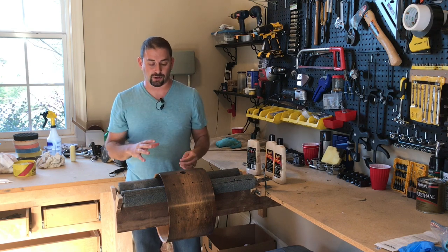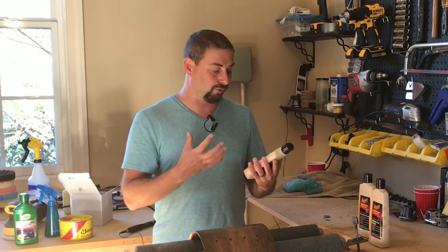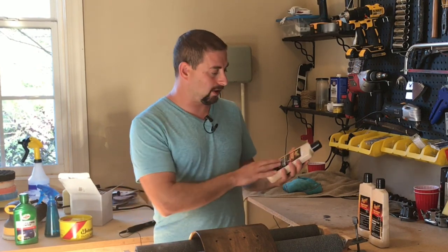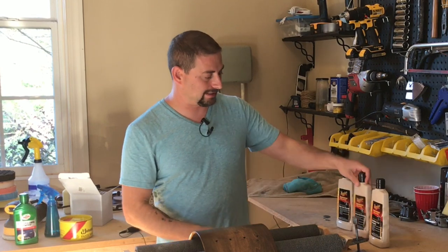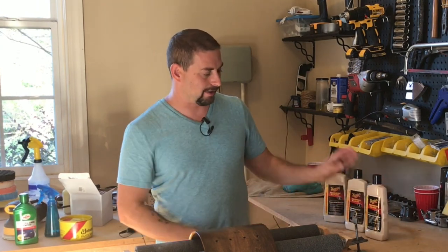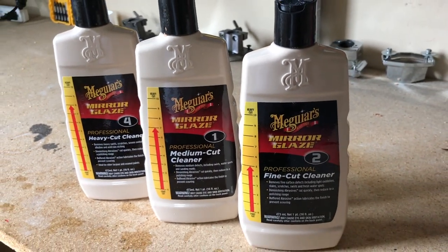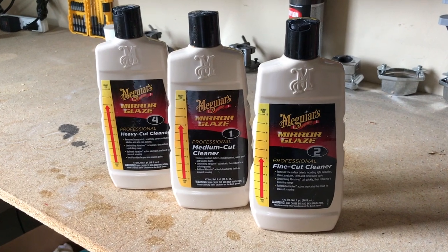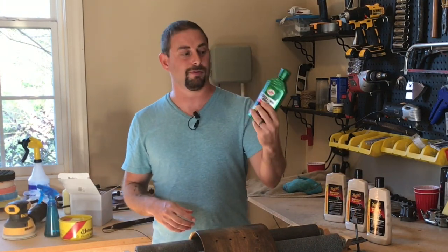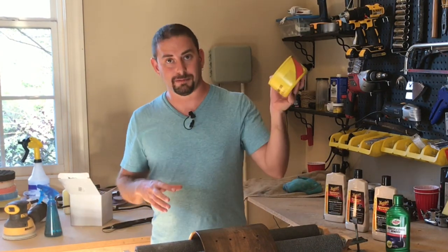Looking online at the best way of rubbing out and finishing these drums, I found these abrasive compounds. Basically this is a liquid that has grades of sand in it. The liquid is spread across the surface and cuts down the finish based on how much abrasive is inside the compound. What I have here is a heavy cut, which has more abrasive in it, followed by a medium cut which is slightly less, and then a fine cut which is even slightly less than that. I'm using the Meguiar's version, but there are a whole bunch of brands that offer the same idea. Then I'm going to use the scratch and swirl remover, which is essentially an ultra-fine cut, and finally top it off with paste wax and we're all done.